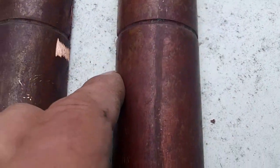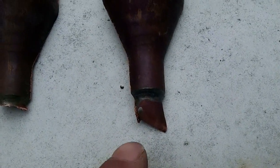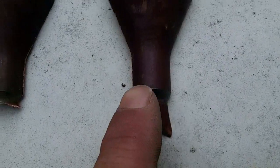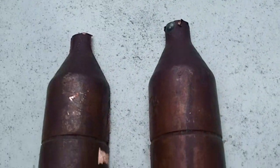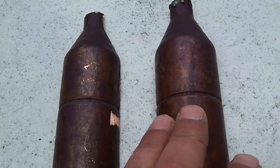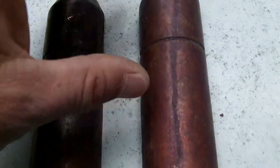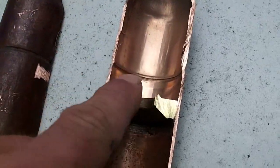This muffler has an arrow on it, and that means it leaves the compressor at the discharge as a hot gas. That hot gas comes through here and out this end, going into the condensing coil. The purpose of the check valve is to keep from slugging the compressor — we've all heard that term. That's the purpose of having the check valve.